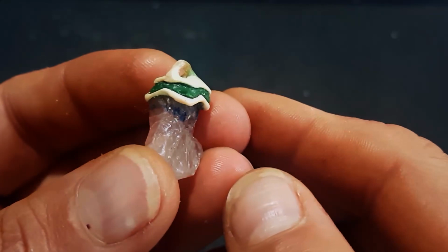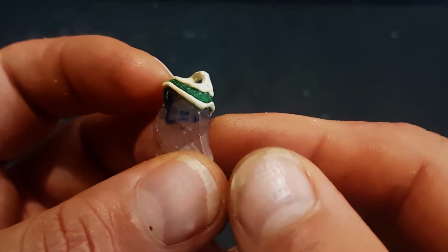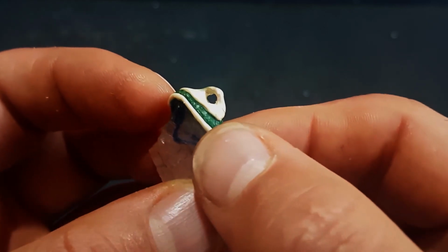Don't worry if that happens, just pick your cap up, put it back on your stone. If it does begin to get too loose to work with, you can simply just seal it back down to the stone by inserting a hot implement between the stone and the wax at intervals around the perimeter. This is the final piece, at least the final wax form.